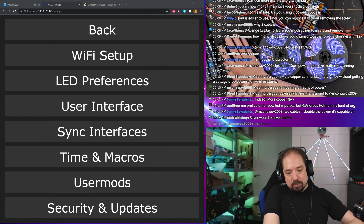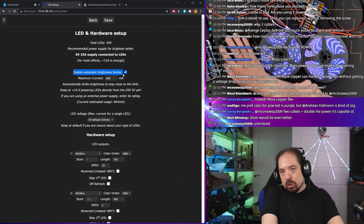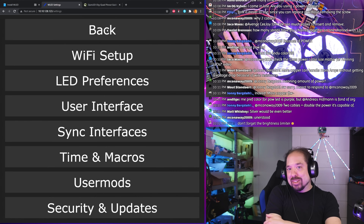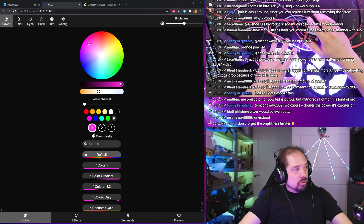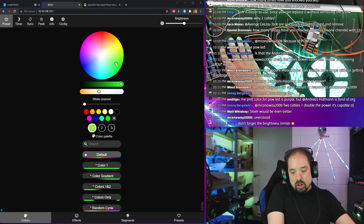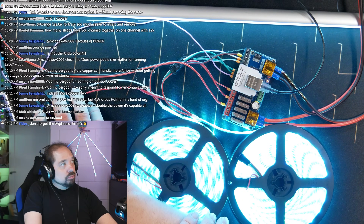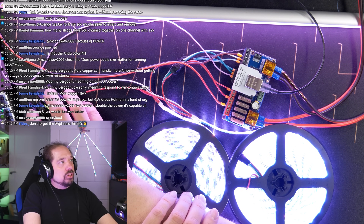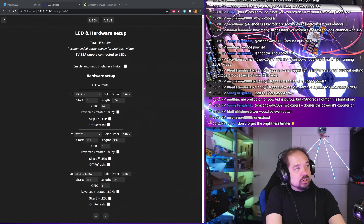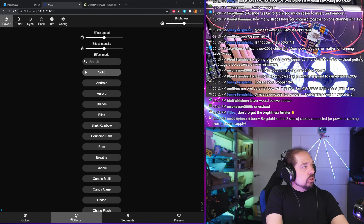Let's save that. You can see in the table it's actually working, but it's very dim. The reason is that the brightness limiter is still on. We're just going to turn it off — and immediately the LEDs are less dim. Now we should be able to change the colors of all of them, and they should all change at the same time. That's a very basic configuration of a DIG Quad — 150 LEDs, 300 LEDs, and 144 LEDs all running through one board.